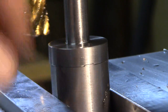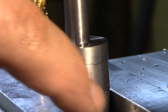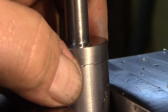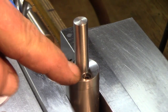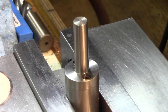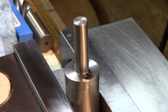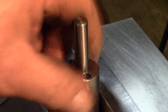We just got to drill our holes, then we have to turn an outside diameter. I drilled the holes and they aren't evenly spaced — one's 352 and the other was 297 — and that's because it's off at an angle. They already calculated out where the holes need to be, so I just went with the drawing and didn't mess with it.